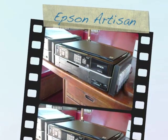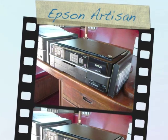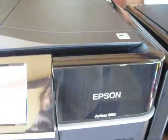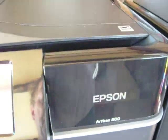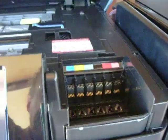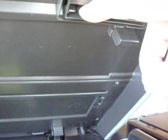Today we're going to go over the installation of a continuous ink system for the model 700, 710, 800, and 810. First, you're going to open the scanner lid — this is where the CIS unit is going to go into. You can see the OEM cartridges are removed, and it's going to be this section right here that you're going to grind a little bit off of.